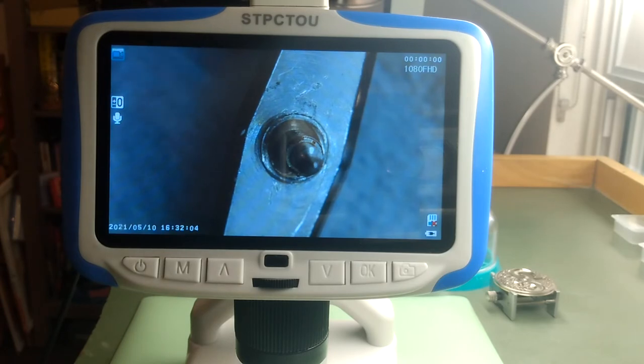Okay, so I'm bringing you guys in for a view of the finished rivet. Recall that I said earlier that our objective was to spread the riveting countersink over the edge of the balance hole. This is what I've attempted to do here, although as I was working on this riveting job, it became more and more clear to me that this hole was kind of badly distorted, and to get a big lip over the edge of the hole would have required more peening than I was prepared to do.